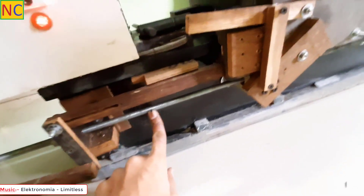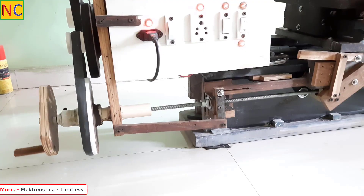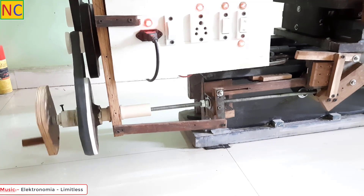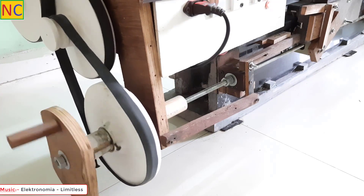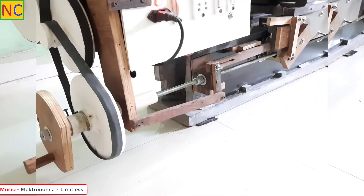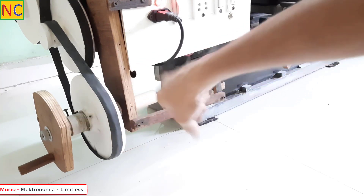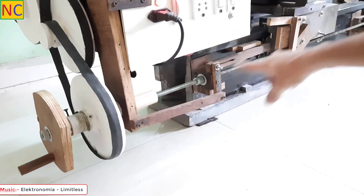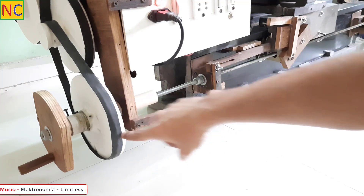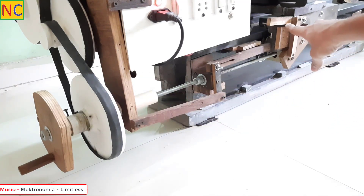The saddle is about to push the lever — see, now it is stopped. The lead screw is not moving anymore. This handle is directly connected to the lead screw, so the handle is moving when the lead screw moves. Once the saddle triggers the mechanism, the handle will stop moving, which means the lead screw is also stopped and the saddle is not moving at all.